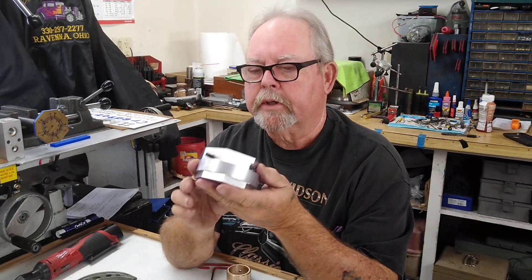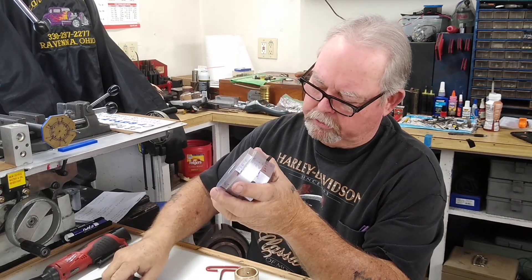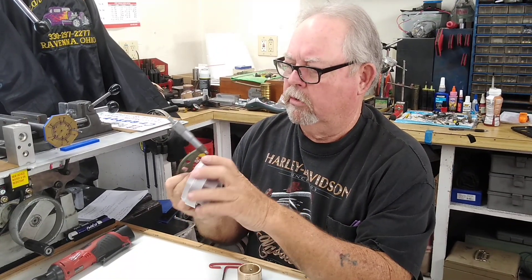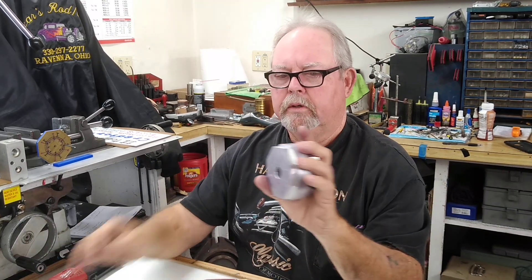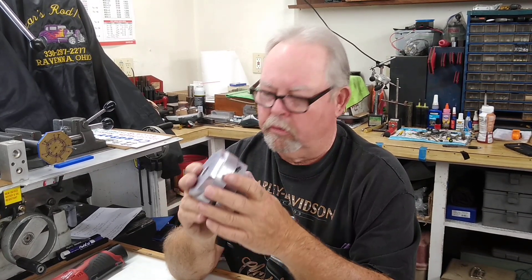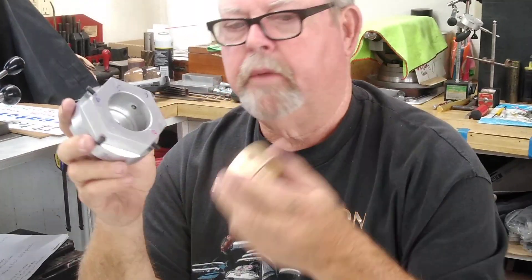This is my concept. I took a rough big piece of stock — it was five inches at the beginning and about four inches thick. I didn't need that much bulk, but we're down to 3.741 inches, almost four inches across. Here is the hexagon out here and then the octagon on the back. We can get many more readings just like with the reference design. It's just a little over two thou over two inches. I made a bushing here — it's an inch and three-quarter.